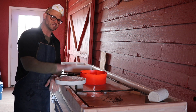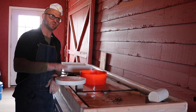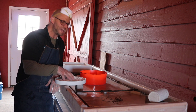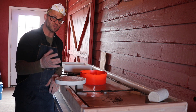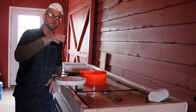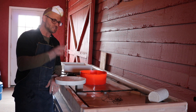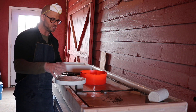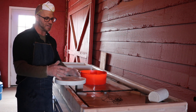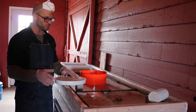We went for this mock-up and it just didn't work out — the mix had too many changes and that kitchen sink unfortunately sometimes just doesn't pan out. I did a whole video on why I think it happened. Today we're redoing that mix, going back to the original mix to see if we can change up the curing conditions to stop that shrinkage, cracking, and all that jazz we often see with larger panels in that higher early-strength mix.